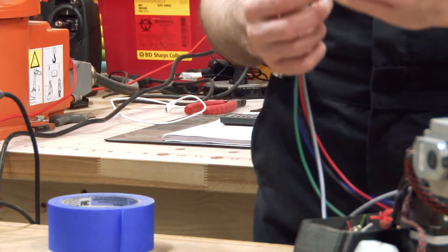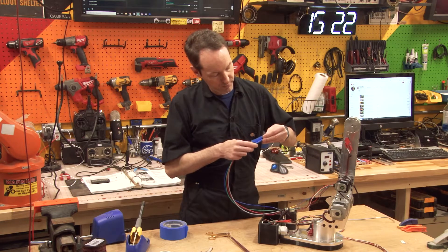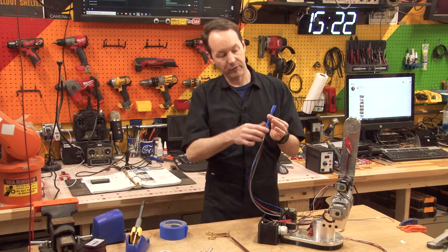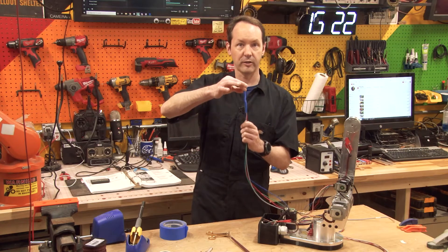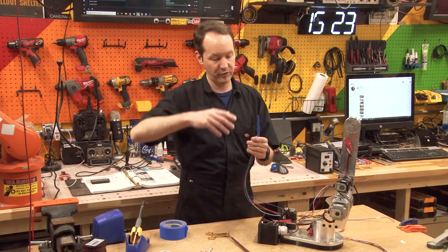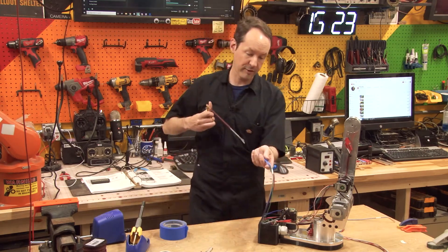When you do this you want to make sure to have a fair bit of engagement up the thing, because you're going to be pulling on it. It's a good skill to have if you're building up wire ends for pulling, like with a fish tape. You want several inches of engagement and several inches of wrap because it's in shear — you're pulling on this end and you want to make sure your tape doesn't pull off. Painters tape isn't terribly strong, so put it on tight.